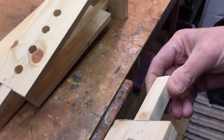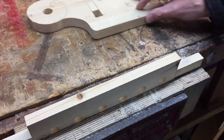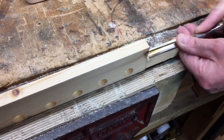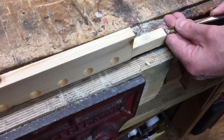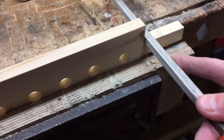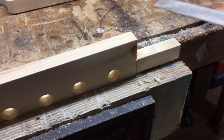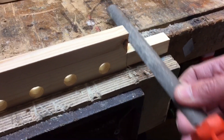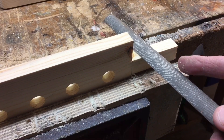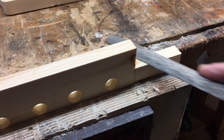I'm going to show how you can just trim them up. You could trim them with a chisel very carefully, placing it in there and taking the smallest amount off — literally half a millimetre. For some of the younger viewers that's going to be quite tricky and I don't want you to cut your hands. You could use a square file to get that corner straight, or a flat file, and carefully file until enough is taken off to ensure the joint fits perfectly.